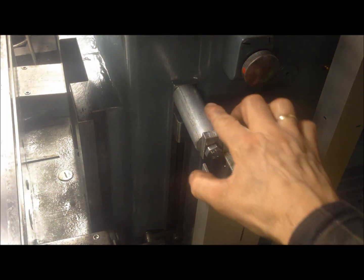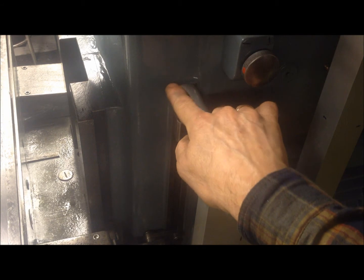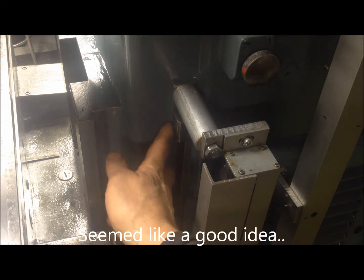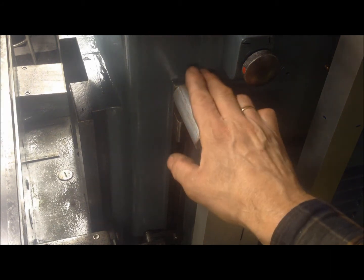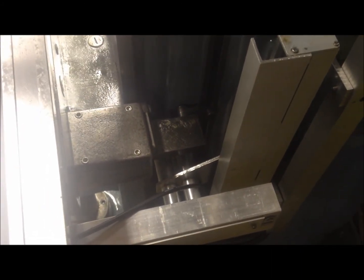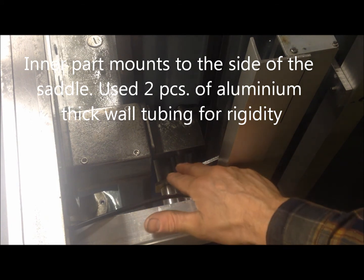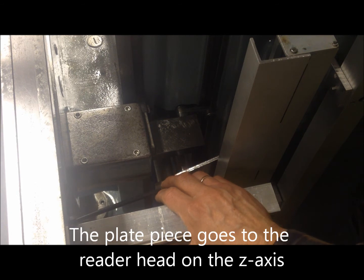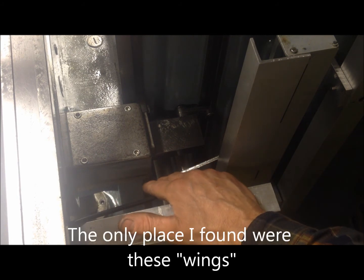I have used upper and lower mounting points. These mountings are actually holes drilled in the casting at the extremes in the channel where you have the stop T-nuts. They are in line now with the maximum travel so they don't interfere. This gives a pretty sturdy mount. The only place I could find on the knee casting where I didn't protrude into the cavity where you have the gearbox filled with oil — I wanted to avoid that.